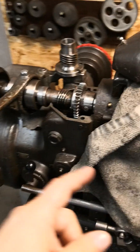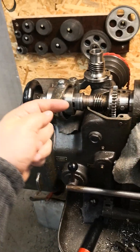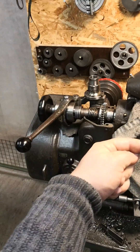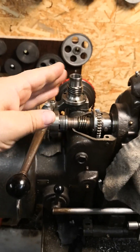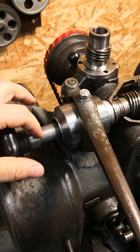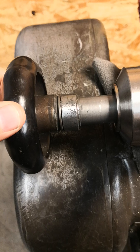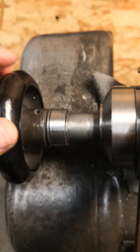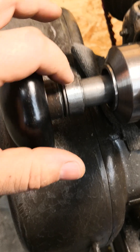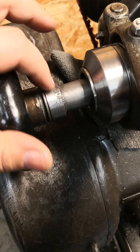When the mechanism is not closing, or it is not opening — let's say it is not kicking out the collet or the workpiece — then this tube here could be slightly misaligned, or it is too fat and so it will not go in properly. I have to turn this ring down here. This was made by a previous owner, just pushed over this tube — this is not original. I would bet on it because it is not good steel and it is not perfectly round, as you can see.